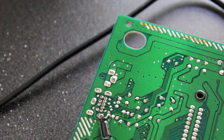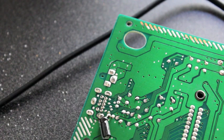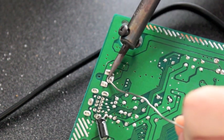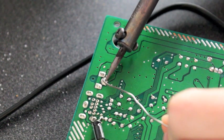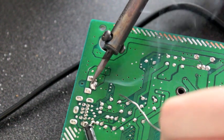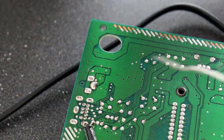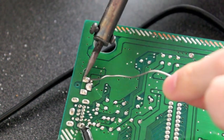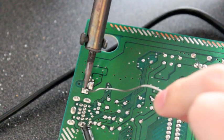So all you do is get your solder — this particular is 60-40 — and your soldering iron, this one's a 40-watt. Doesn't really matter, we're not applying that much heat. Just heat, which will reflow the solder. And by adding new solder it makes it nice and shiny. Look at that — beautiful. While you're there, you might as well do the other joints. Never really hurts — freshen up some solder, make it a bit stronger, make it last a little longer.